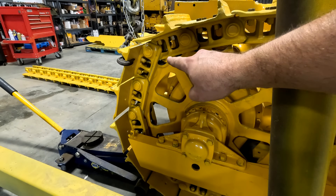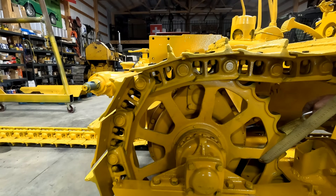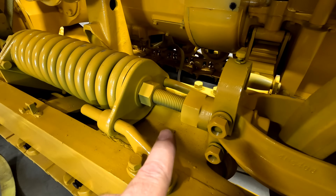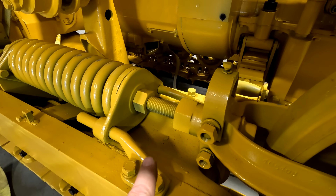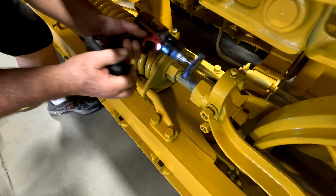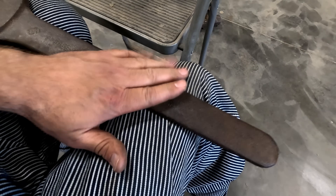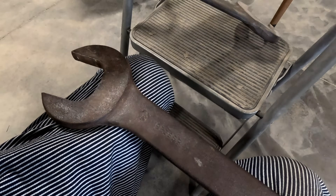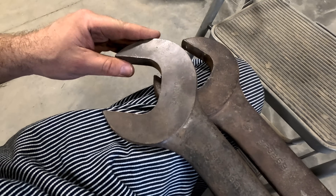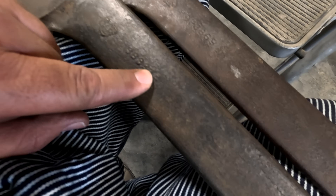There's still tension on the crane. I'm going to let it down and see if that other pin will seat in that tooth of the sprocket. We got this to settle down on the sprocket like it's supposed to be. I'm going to get my track adjusting wrenches and we're going to back this off about as far as we can get it. For adjusting these tracks I'm going to be using this 9F-3869 — this is an original Caterpillar wrench — but I also have this other track adjuster wrench, the 3B-3874. The head is tilted a little further and this one actually works a lot better to get in there.